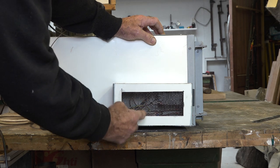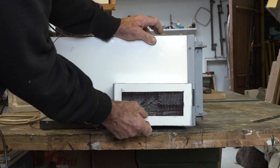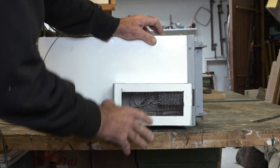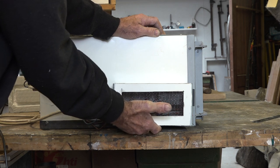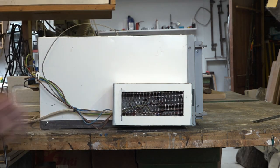The box that houses the PID and the solid state relay — the relay has a half-inch aluminium plate which it's fixed to, sitting on the bottom, and that's purely to pull heat out of the relay. It's never really doing a lot of work; it never gets hot — I've never even felt it get warm after the oven's been on for two hours. So it's doing a great job.